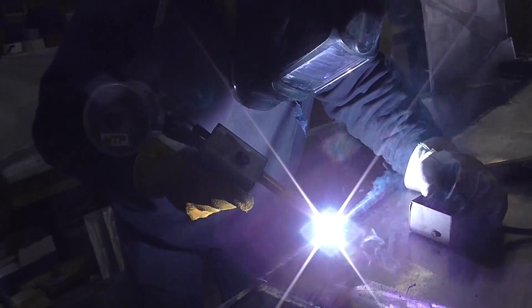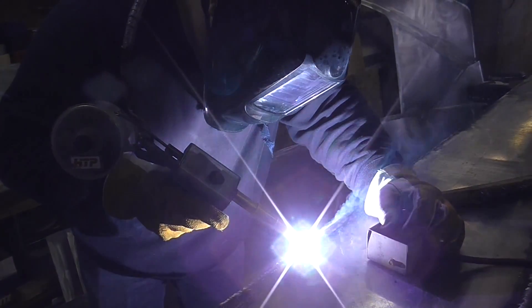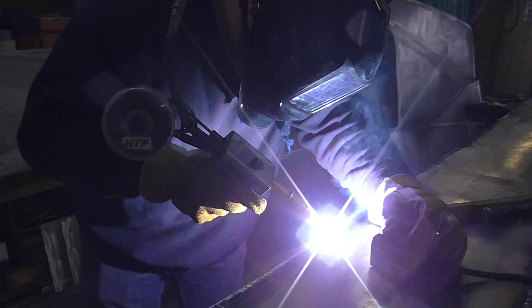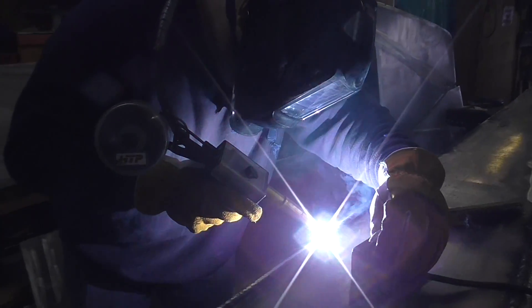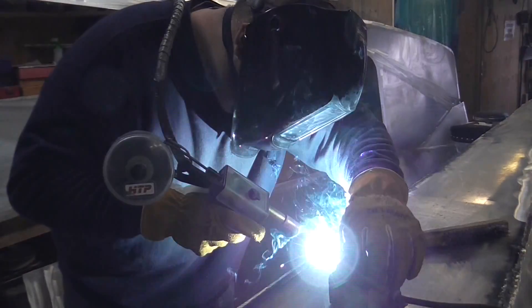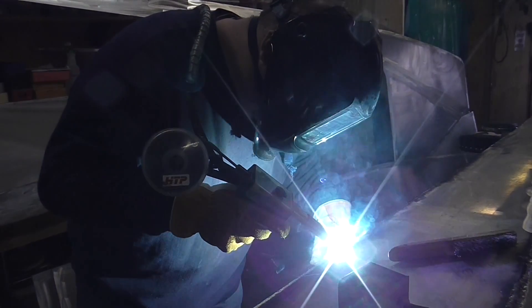The idea is not new. Here you can see me welding with a spool gun, and on my left hand there's a little box from Lincoln Electric that plugs right into my engine drive that I can adjust. Stick welders used this for decades to adjust amperage, and I use it to adjust voltage on the spool gun. Welding aluminum is more about how fluid the puddle is and how long your arc is, so you need to adjust the voltage more than the wire speed to make it hotter or cooler. As the material heats up, I take a little bit of voltage out as I'm welding, and it works real good.